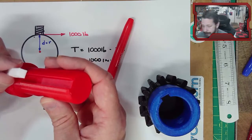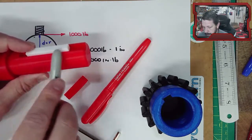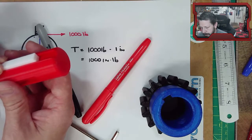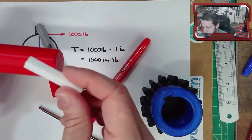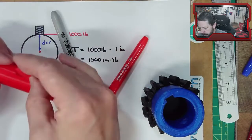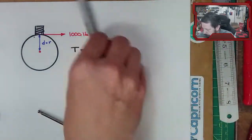Keys fail by shearing along the shear plane — just a regular shear calculation — or by crushing: you exceed the yield strength and a corner gets rolled off, or the fit becomes loose and the key works its way out over time. Since the shear failure for a rectangular key is straightforward, we'll do a calculation on a Woodruff key to show how to handle its geometry, since there is one confusing thing in their chart.